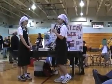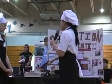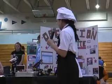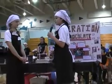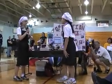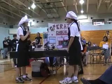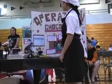He uses a rotation sensor to know where to go for the chocolate. The chef then sends an IR message to Lazy Susan, who then uses a rotation sensor to turn 90 degrees. It sends an IR message back to the waitress and it starts all over again. The sprinkle machine works by itself using a touch sensor to know when to start. We had to do a lot of chemistry to find good temperatures for the dipping. You can see on our board, we have the chart between our temperature sensor reading and the real temperature.